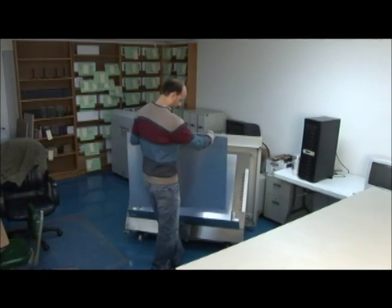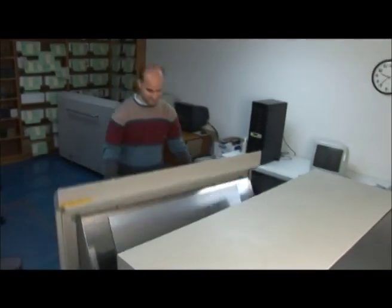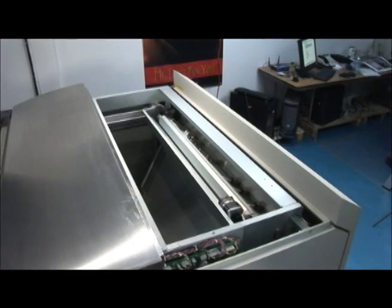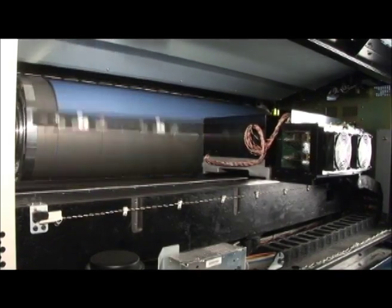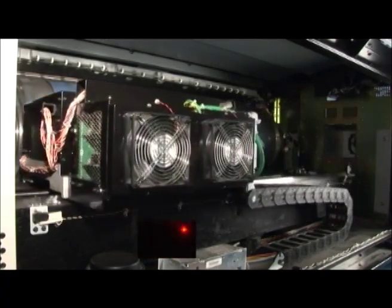Computer technician Tim Yeager begins by loading a large sheet of emulsion-coated aluminum into the developing machine. Suction cups pull the aluminum sheet into the machine, then a special laser head etches the emulsion side of the aluminum, leaving behind only what's needed for printing.